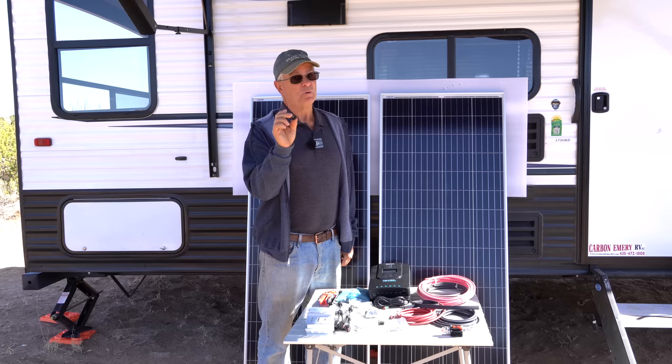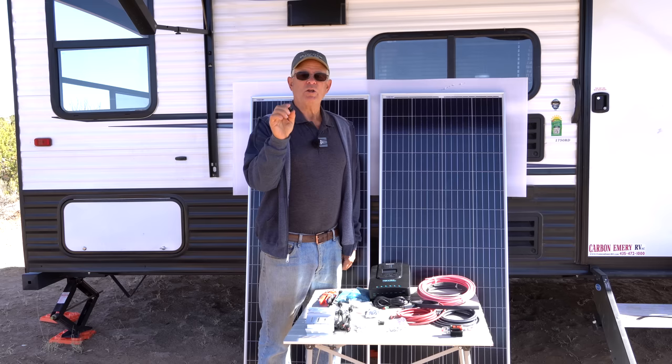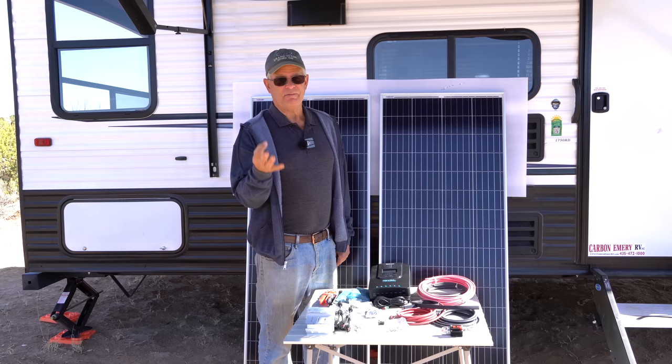They'll work on fiberglass roofs. They'll work on rubber roofs. But they also seal out water. In an abundance of caution, we're still going to cover up all of those screws with a sealant, Dicor, but these are fabulous. I strongly suggest the well nuts. Straight up.